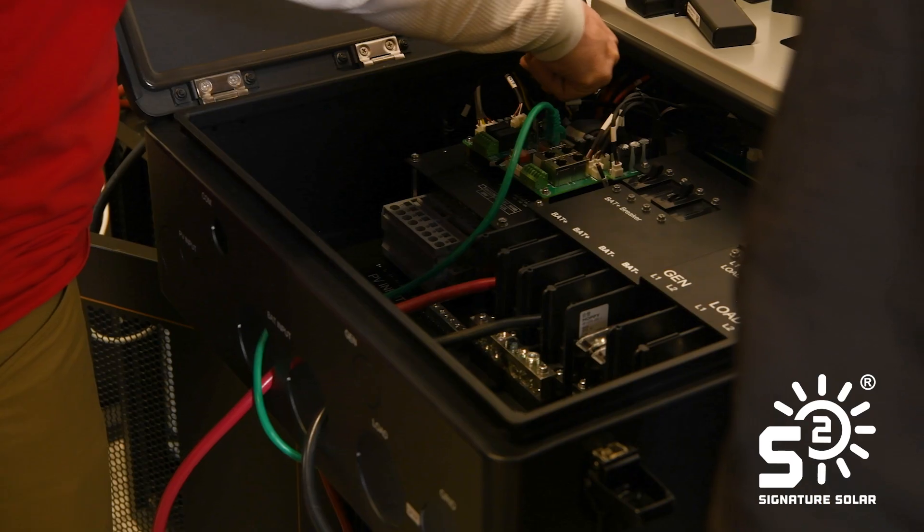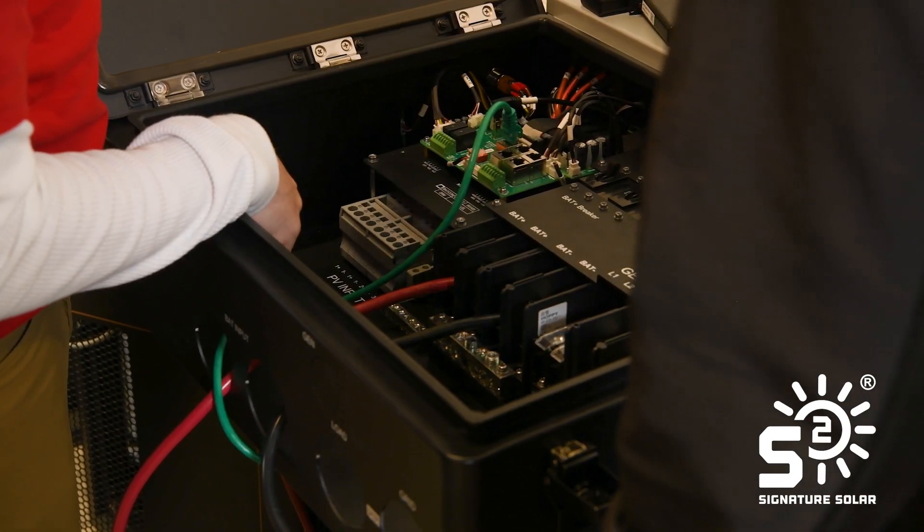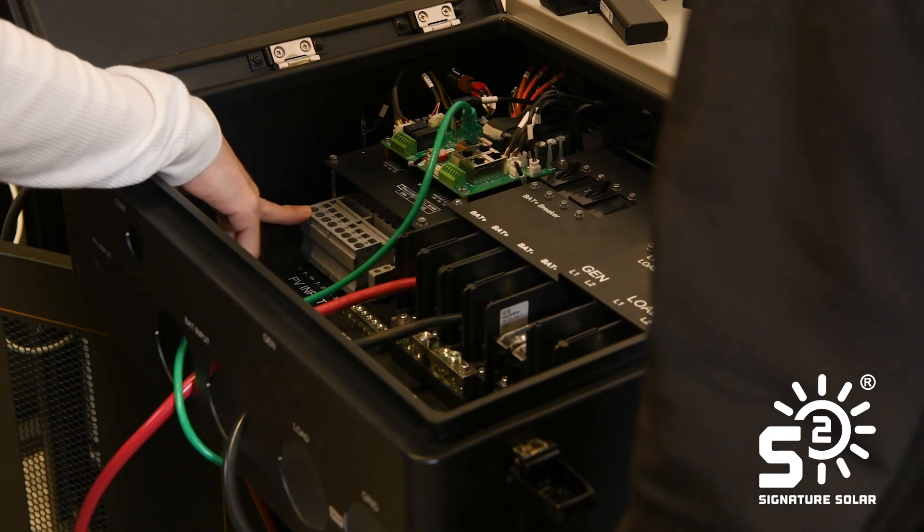I calculated it all out. His voltage drop came out to 2.83%, which is within acceptable amounts. I made sure he got all the information he needed and that his wire gauge should be eight AWG as a minimum. We are trained to know how to calculate strings and arrays so that we know what customers are going to be using, if they have any questions about expanding their solar or if they need more energy for their system.